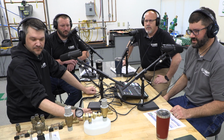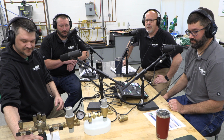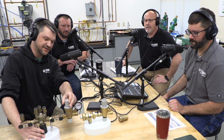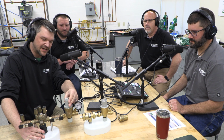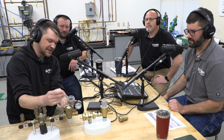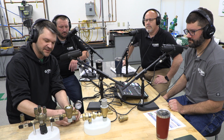Right. Matt, I think you spun one loose here, so you could even show everybody there on the camera for those who get to watch on YouTube. You can spin that cartridge apart. Yeah, so this is not usually hand tight, obviously, but for ease of demonstration, it's as easy as taking this plastic cover off, this tension spring, which will set the pressure that you've got dialed in on your set screw right here.